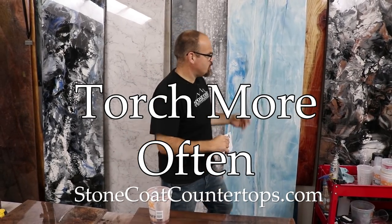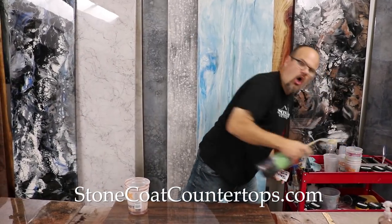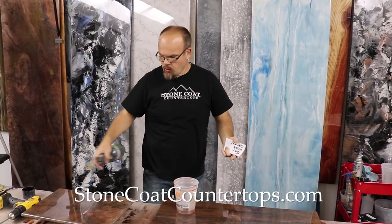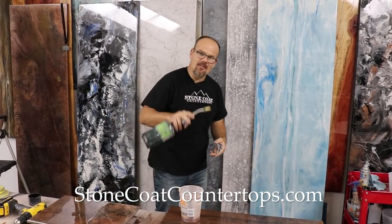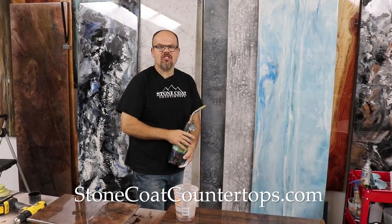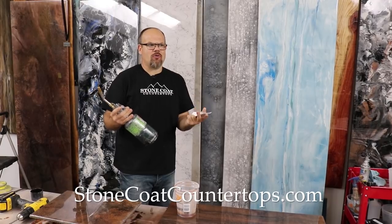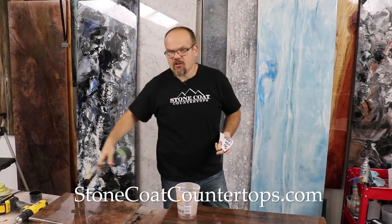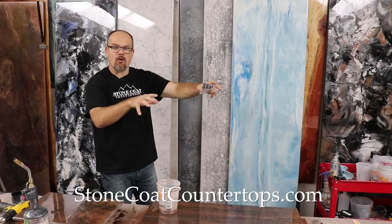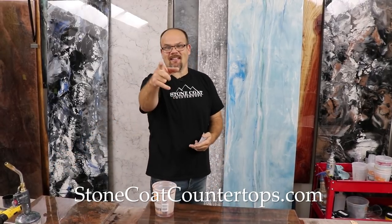Torch more often. Especially when you're doing dark colors, when you torch with a propane torch, you're not trying to get everything out all at one time. You're going to torch it out, let it rise again, torch it again, and do this as many times as you need. If the epoxy is a little colder, it's going to take a little longer. If you have a smaller batch, you entrain more air, so just be patient. Don't sit there in one section and really try to get it all out at once, especially dark colors — that's where it shows that it's got some white fog in there. Simply torch it, walk away, torch it, walk away. Wait about five minutes in between. If you're doing a really big project, when you start over there and work your way to this corner, usually you're ready for your next torching as soon as you're finished with this side. That's a pro tip.